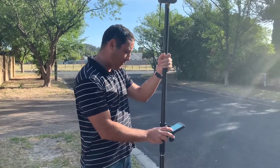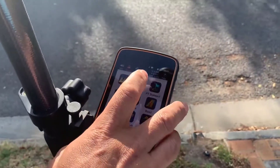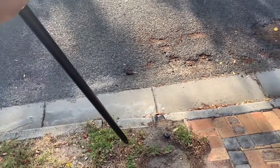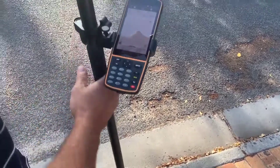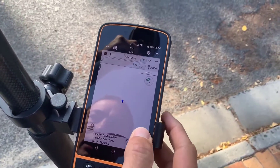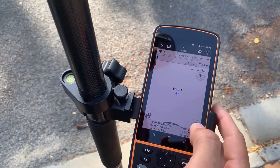To start, I'm going to immediately go in and survey a point manually. I'm not showing picture-in-picture — I want to show you the actual process as I measure a point. So first I'm going to locate a point on the ground and quickly measure it with the bubble intact, give it a code, and measure that. I'm using the display bubble and the bubble is fairly plumb at the moment.